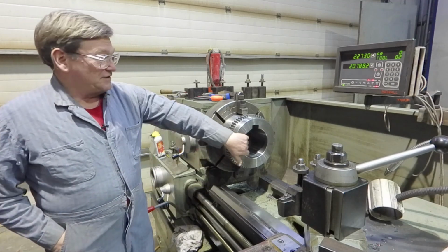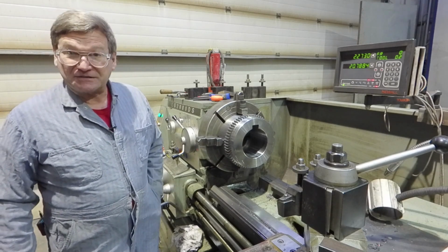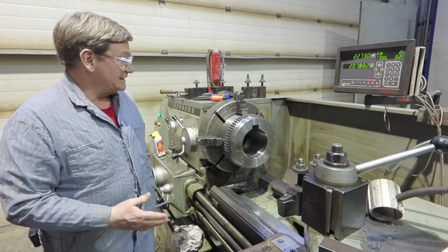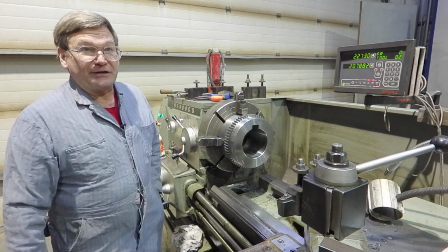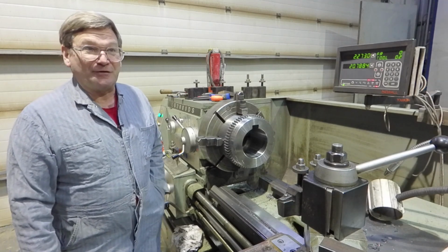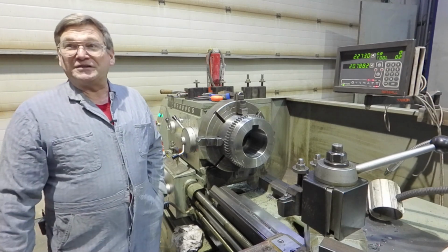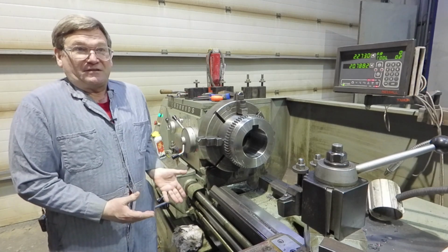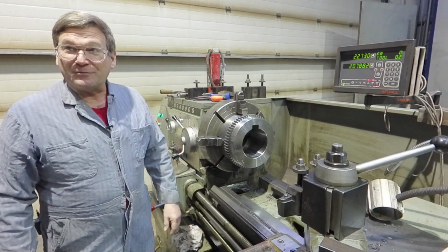The original finish is not a ground finish, but it also is 4/1000ths off of the specification for the part. I think the reason for that is that the specification for the part was copied over through time from notes made in 1946 when they originally made this machine. But when you have a multi-million-dollar machine in 1946, they get rebuilt and reused. They don't upgrade them.